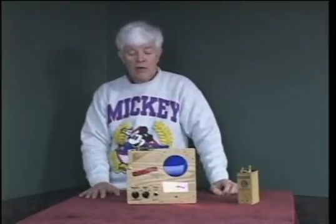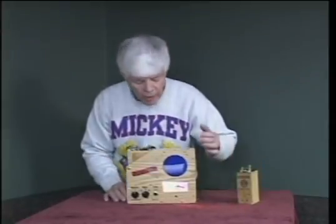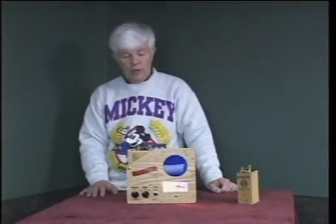Ideally you don't care what the coil draws at all other times — you just want to make sure that the first pulse it ramps up and fires at is the same for all four coils. With a strobo spark it will do that, because the current you're reading on the meter is the current of the first spark.